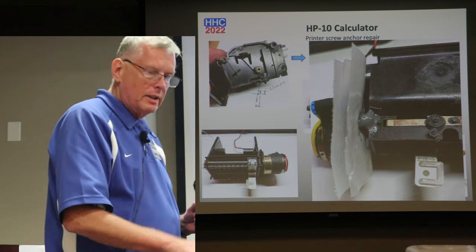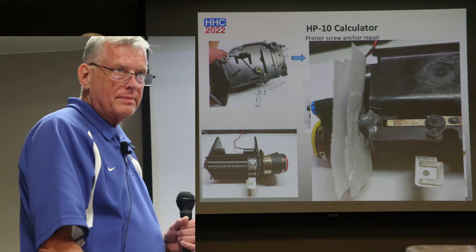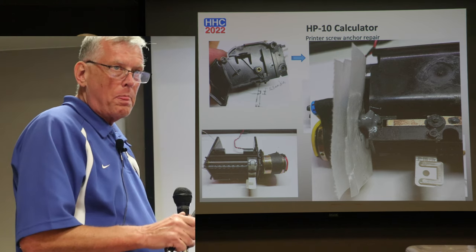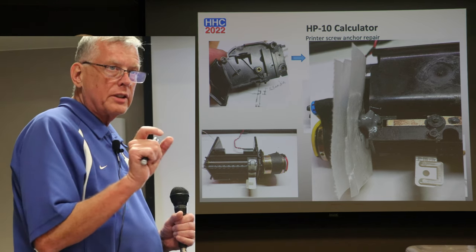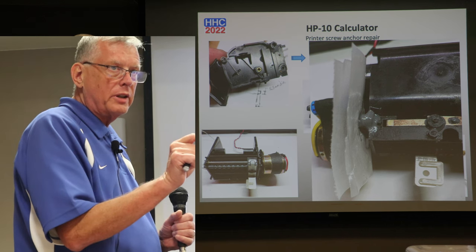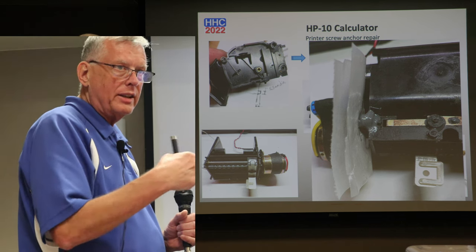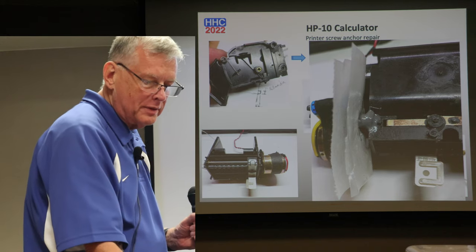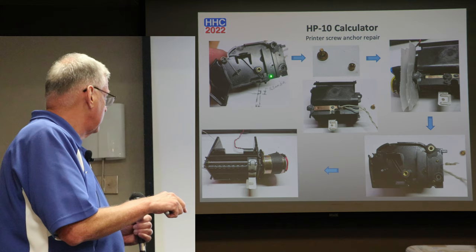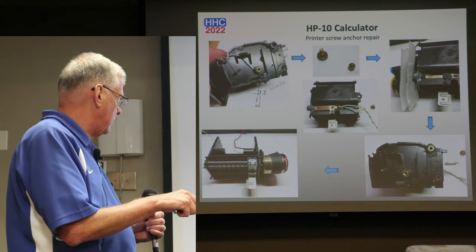And Jim, when you glue it like that, put the screw that's going to end up in that thread. That's what I did. Oh, okay. But I didn't want the screw, because the screw actually screws farther past the brass insert. I didn't want the screw to be filled in with epoxy because it had epoxy behind it too. So basically it was from here to here.